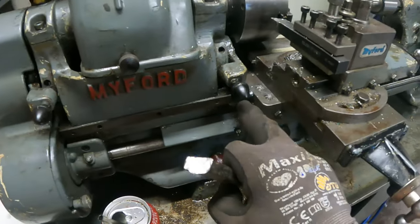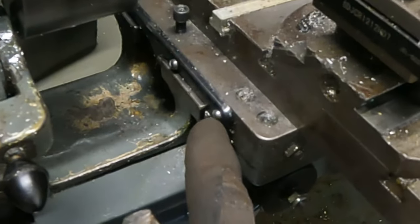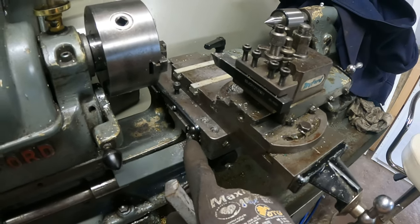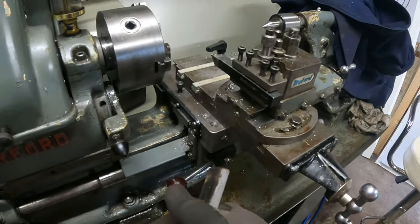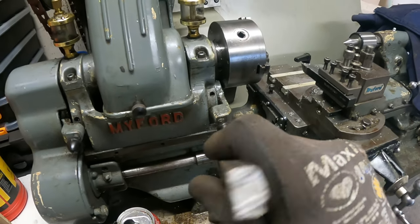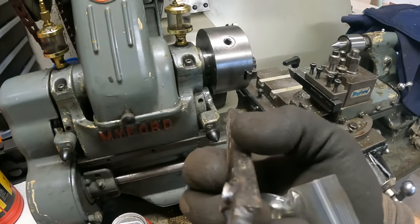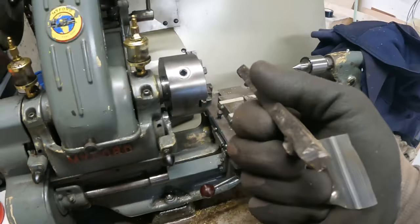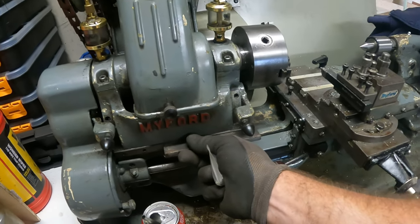That will bring me past that little car there, if I wind this over, because I don't really want to run stuff in there. You know, you've got all sorts on there. I really want it to pop up into this vicinity here, so that will bring it out a bit. But with this stock, the profile, let's do that side, it's not very clean, it's a little bit round on the short sides. So I was thinking of running that through the milling attachment on the lathe and just squaring that up, so I've got a nice fixing point there.